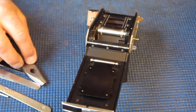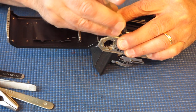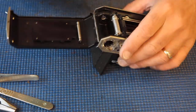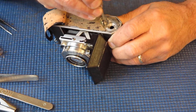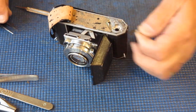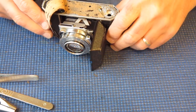To make special tools like that, the trick is you go down to the hardware shop and buy the cheapest pliers you can find, because they're likely to be made out of not particularly hard steel, and then you can come home and grind them and drill them to your heart's content to make them fit the job. If you buy top quality tools, they're especially tough grades of steel and you can't easily grind or modify them. This little catch that holds the rewind button in the locked up position — that screw is loose. That in turn is released when you move the film advance lever to unlock the button.